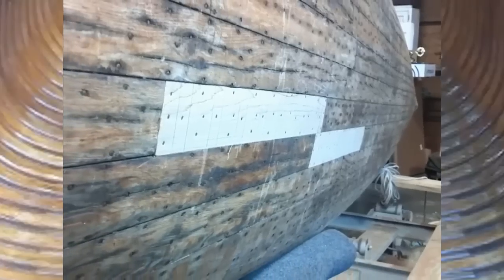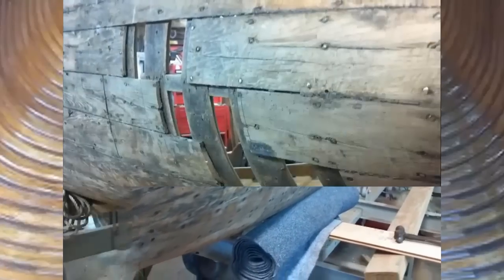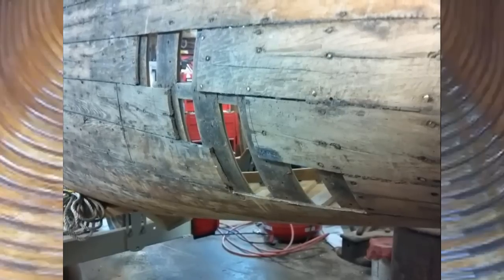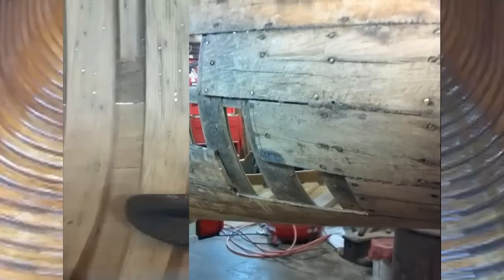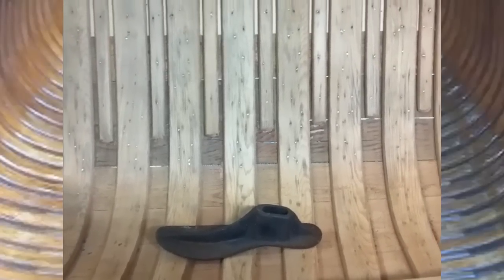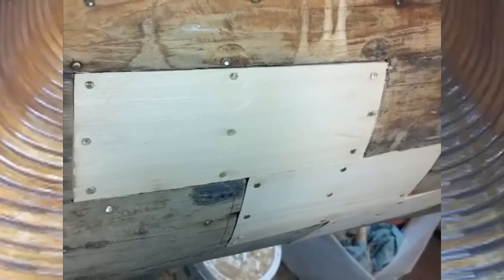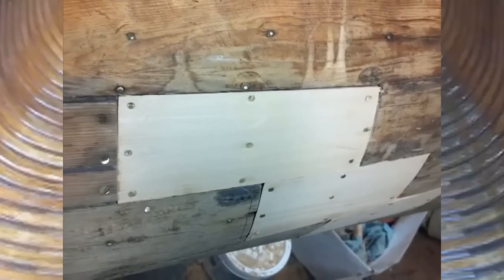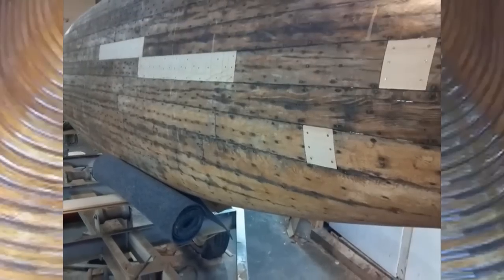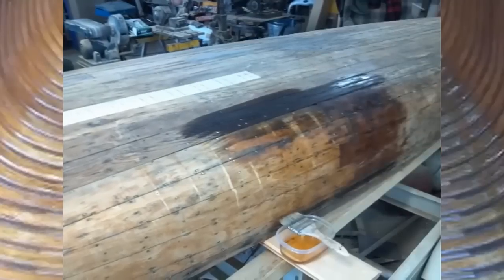I found all kinds of bad planking and replaced it. You put all these on with brass tacks. I did the flat spots earlier because the curved ones are a little trickier. I used a cobbler's clenching tool since I didn't have a clenching iron, but that cobbler's tool would reach in and round off those brass tacks even in the curved areas. That worked out pretty good.